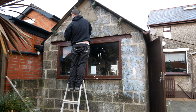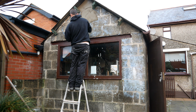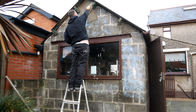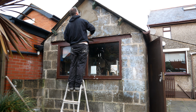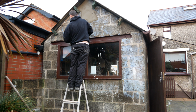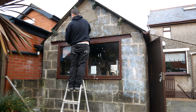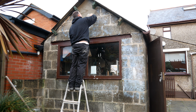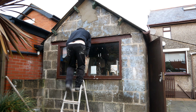I'm gonna take my time, work around these wee wooden corbels, nice and handy. I think they're actually the trusses coming right through, which are holding up the actual roof itself. So just take my time, nice and neat, working around the corbels, filling in. There is a slight gap just between the roof and them, so I'm just taking my time filling that as well. And pretty awkward because I can't get the full refiner trowel up in there. It's a wee bit too tight.